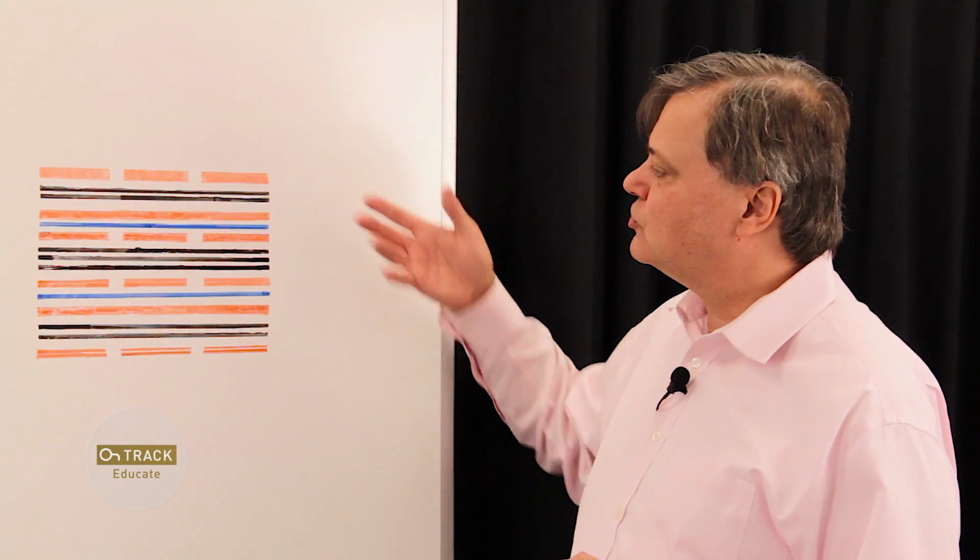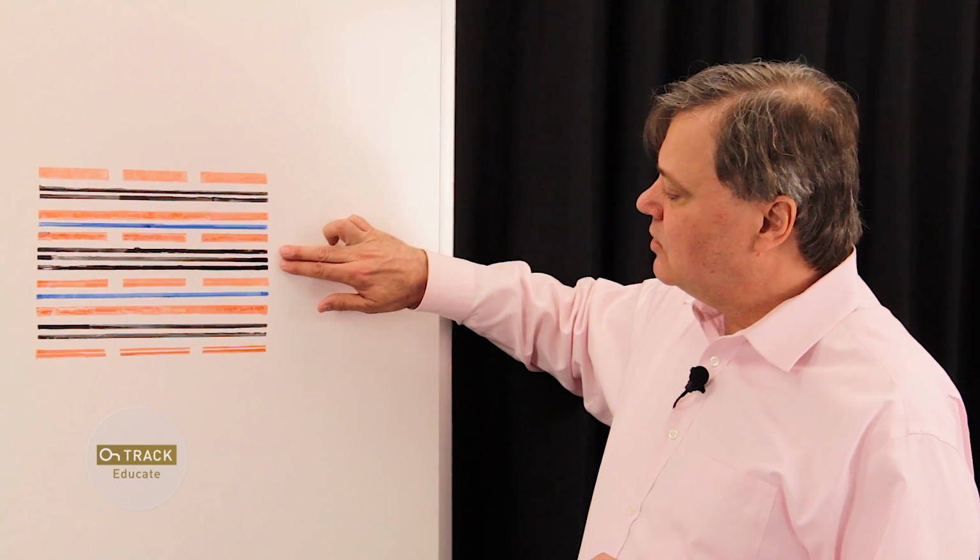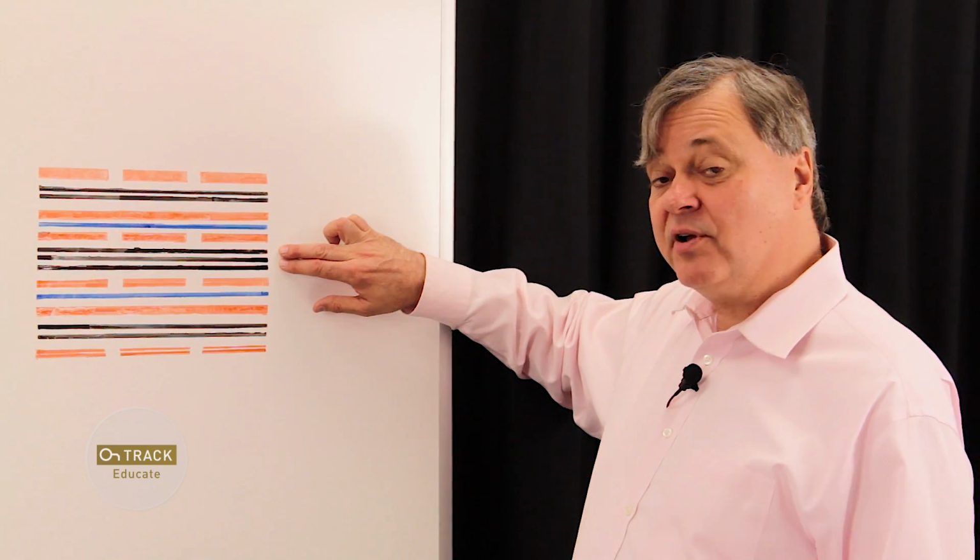Now these are suitable for your low speed type signals, your analog signal processing, and anything else that does not have to be impedance driven. Then we use pre-preg material at the center of the stack up to build up the stack so that we have the appropriate final thickness of our board, generally 62 mils.